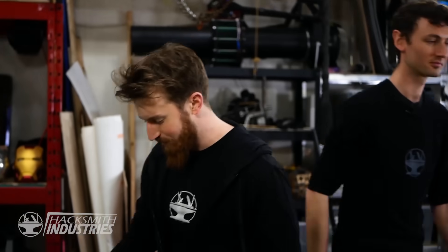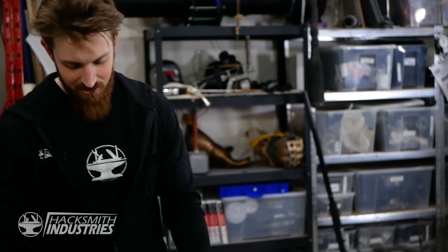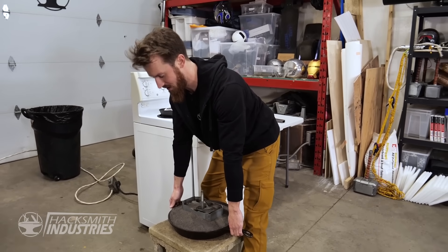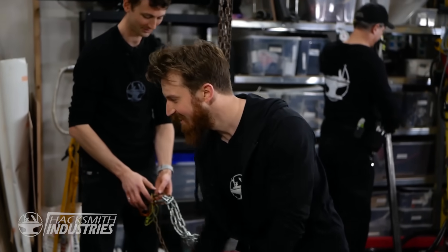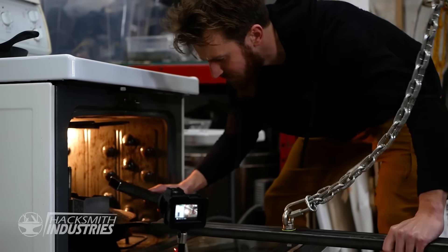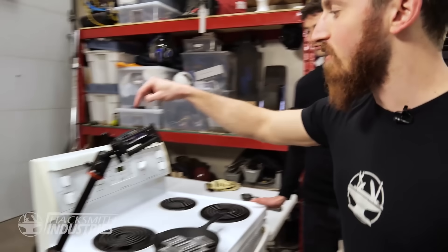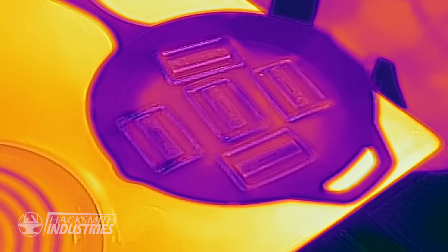The general idea is we've got a nice big cast iron frying pan. We're going to surround it with iron filings so we can get a consistent heat mass around it. It's heavy, so we've set up a chain hoist from the ceiling to lift it into the oven. Time to start cooking — we need to melt down some lead. Now that the hammer is hopefully up to about 500 Fahrenheit, we've got a thermal camera to check. Let's turn the burner on — it heats up real fast. You can literally see the heat starting to seep through.